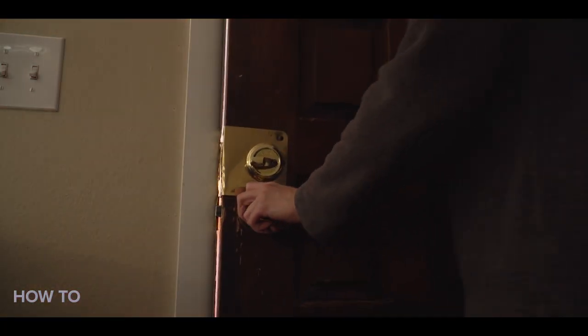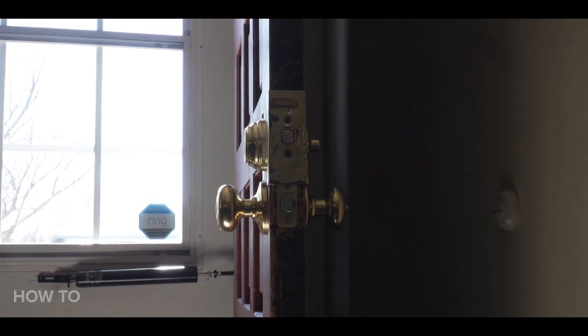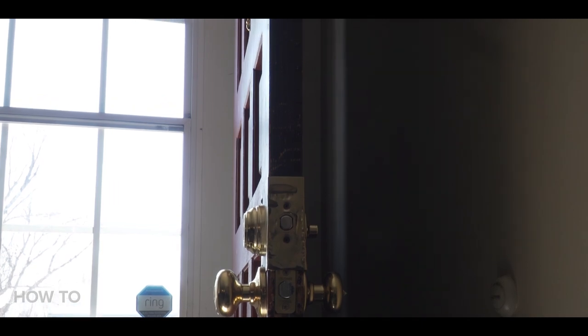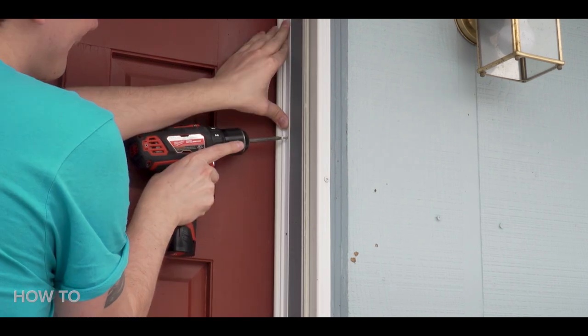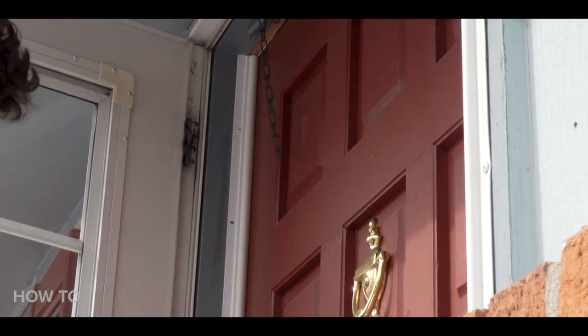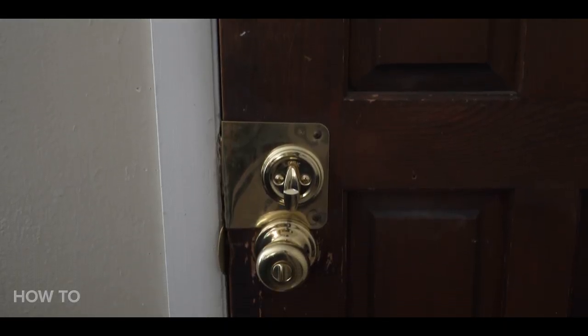Close the door and make sure it's locked before you install the weather strip. If it's not locked and you install the weather strip too close, you could put a lot of tension on the lock and it could break or come out of the wood. Line up the weather strip tightly on the side of the frame but don't press too hard against the door. Using a drill, put the first screw in the middle and then do the top and bottom next. Now do the same steps for the left side and again for the top — and now there's a lot less light shining through the front door.